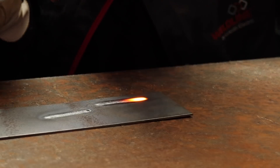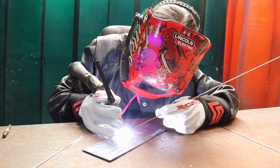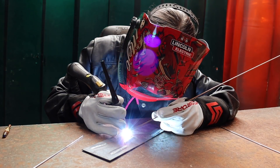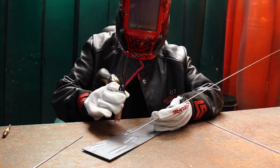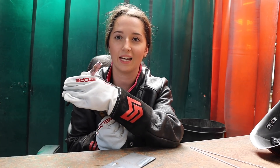As you can see in my steel welds, they are quite precise as I have quite a pointed tungsten. As you can see there, I just dipped my tungsten in the weld pool, which is obviously not good. It means it contaminates the weld and also makes the tungsten dirty, so I'm going to have to go clean that again and make it clean and pointy.